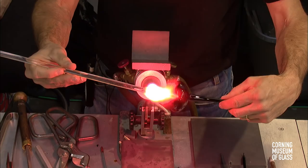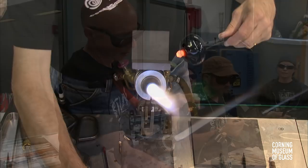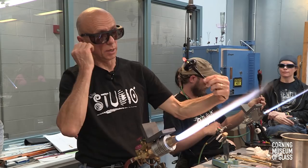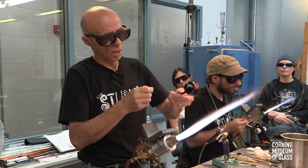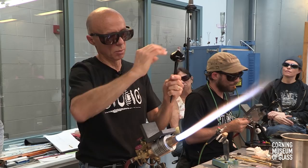So I want to tell you something about the foot, if you saw what I was doing. First I started with a round bubble, I blew and pushed it, so it was a little bit lower at the bubble. Then I heated it up left, center, right, center, left, center, right, and while keeping pressure with my mouth, I pushed in even more. So I ended up with a lower bubble.